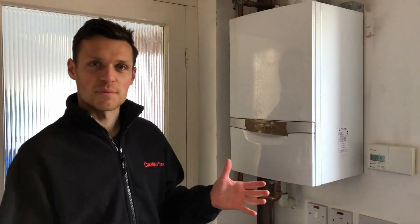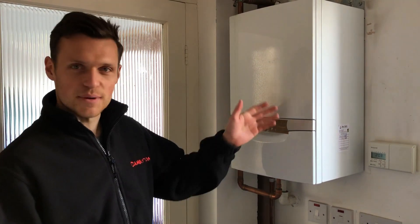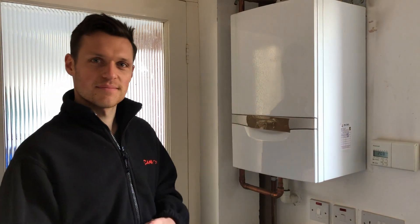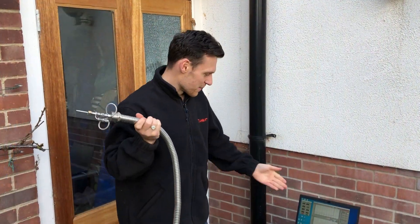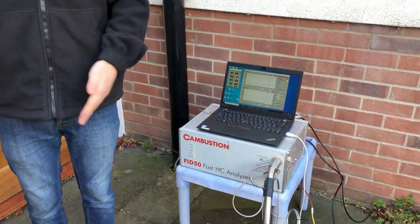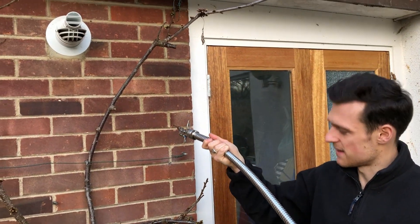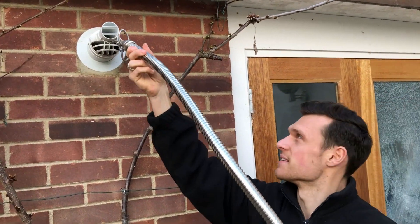This is another example application of the FID50. We're going to look at the hydrocarbons from a cold start of a domestic natural gas water heater. I'll take you outside to have a look at the sampling point. We're going to log our data through our laptop here. We're using the three meter heated line because of the high moisture content in these combustion gases. I will put the probe down the flue exit up here.